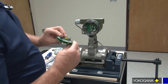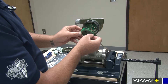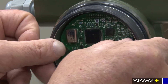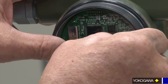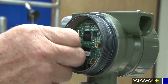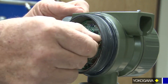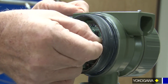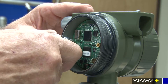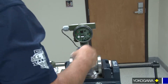When you're putting your new amp in, you're going to be engaging on these pins and these pins here, so make sure you're orientated correctly. Line your pins up into the holes. This may take a time or two, so be gentle with it. Make sure you get your pins all the way in. Now that we're set on the pins, ease these in finger tight, and then tighten just a little bit more to ensure that it's going to stay. Be careful not to over-tighten them.